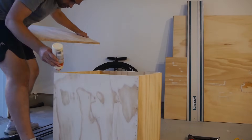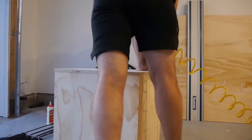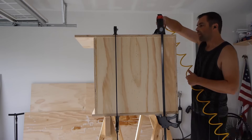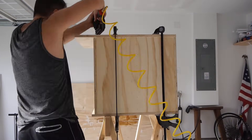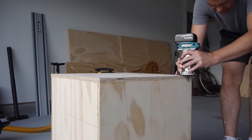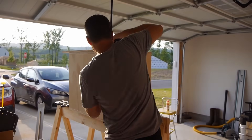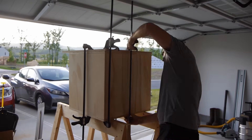This was a 6.1 cubic foot sealed enclosure, which works out to about five and a half cubic feet when I remove all the volume of the bracing and driver — so net five and a half cubic feet. It has two baffles and I did it all out of one sheet of three quarter inch plywood. I sped things up by nailing it together, although I did clamp it and let the glue dry. I only have four clamps and I wanted to speed things up and not wait a full 24 hours.